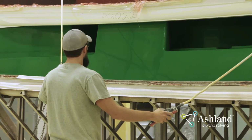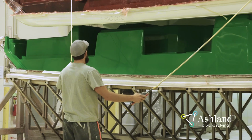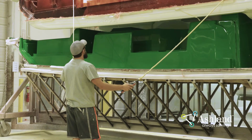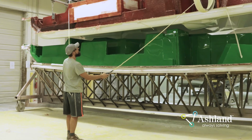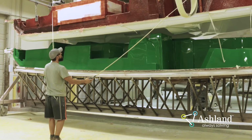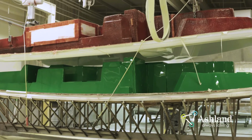Apply even pressure on the lifting hoists for easier demold. Using excessive force can stress parts, which can result in cracks developing as the part ages. In extreme cases, parts can actually be cracked during the demold process. Some parts may be more challenging to demold due to part design or a slightly negative draft.